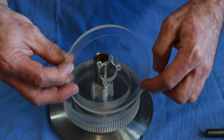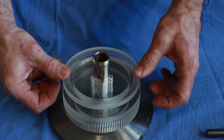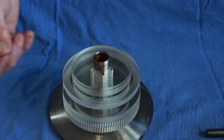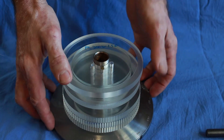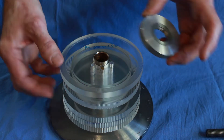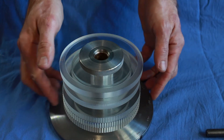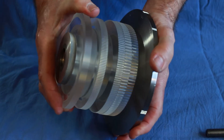This rosette has got a pumping face - the waves are just milled into the face here for pumping action. So this one goes here. Spacer. Spacer again. And my last rosette goes last. Now you can see all the rosettes are in place. In order to lock them in place, I've got that nut, which just goes on top of the barrel. I tighten everything together so it compresses all the rosettes onto the barrel. Now all the rosettes are pretty solid to the barrel.